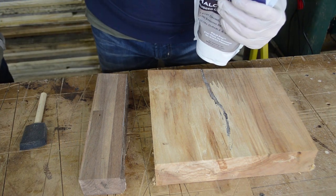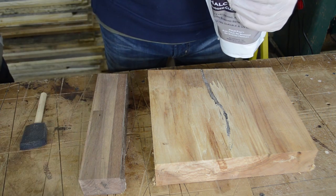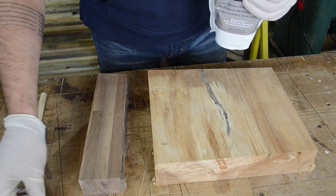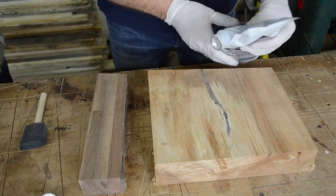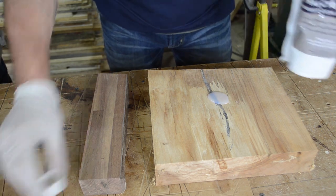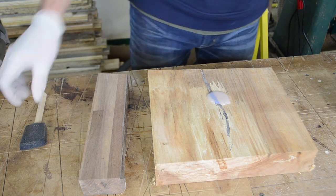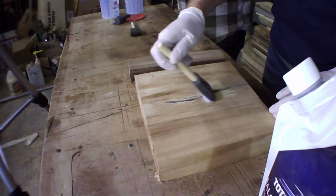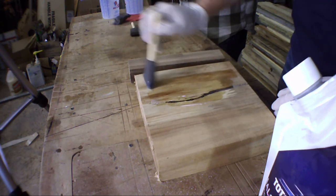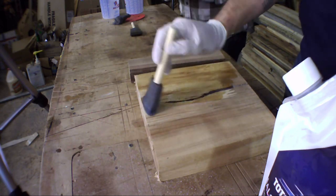So, of course, one of the big reasons we're doing this is because this is probably one of the favorite parts of all of our projects, seeing the wood come to life with the finish. And we've mentioned a little bit earlier that this particular product is a marine-grade varnish, and it dries to a UV-stable gloss finish. This particular varnish only comes in gloss. If you want to dull down the gloss, you can dilute it up to 20%.